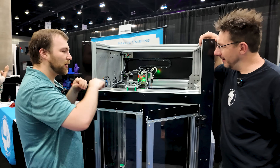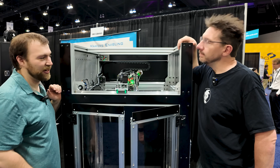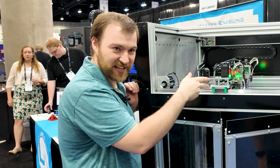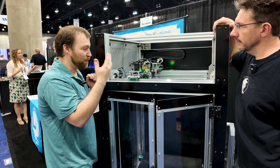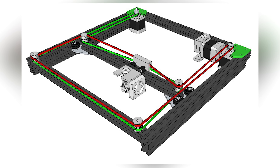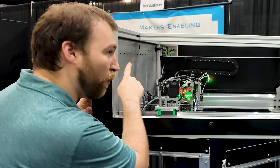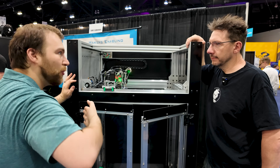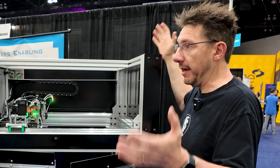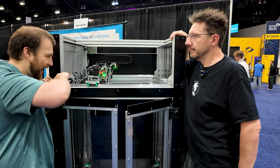Those larger platforms will probably use a 20mm wide belt or more. The longer the span gets, the worse your responsiveness gets — you get less tight response on the tool head and cross part. This uses two motors — one in the back and one here for the X axis — so you get double the actuating force and double the stiffness from two belts. With CoreXY you only get two belts but have to move everything at once, especially bad at 45-degree angles where one motor powers the entire bar and tool head. It's easier to add motors to a single axis rather than doing diagonals at scale. Shorter belt lengths and more motor per axis.